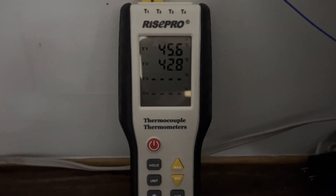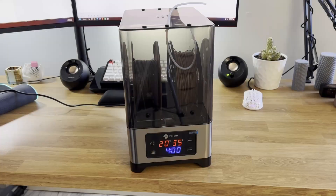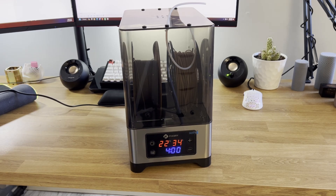I did not notice this issue at 60 degrees, where ABS is recommended to be dried. After observing this temperature discrepancy, I reached out to FixDry and they suggested that my thermocouple could be located far from the sensor, but that suggestion didn't really match the problem at hand. I then sent them the clip displayed in this video and they stated that at higher temperatures, an algorithm is used to introduce a coefficient to calculate the temperature of the air outlet, since these higher temperatures could damage the drying consumables. Their responses were fast and they had great support, but I didn't fully understand this, as the readings at 70 degrees on my thermocouples were similar to my readings when the dryer box was set to 50 degrees. I can definitely recommend this product for PLA and ABS since it seems to reach those temperatures and hold them without any issue, but I'm truly unsure about how this algorithm and coefficient work at higher temperatures.